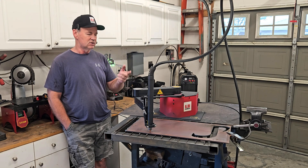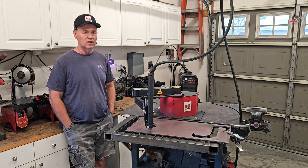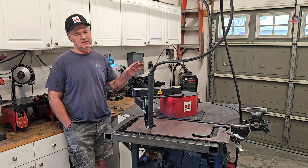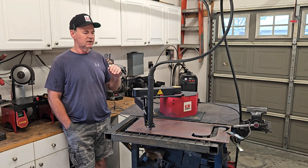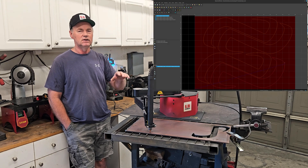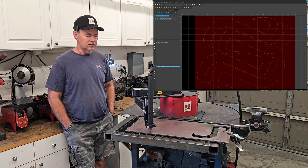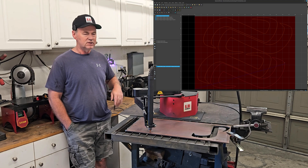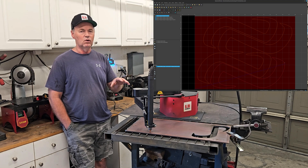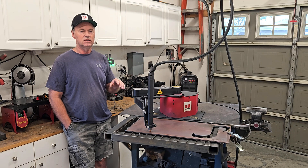The only material I have is the remnants from the piece I bought just to try it — it's a 12 by 16. So I did something I haven't done before: I got into SheetCam and did nesting. Not nesting like pregnant ladies building a house — nesting meaning taking the parts and arranging them on the material so that you can maximize your productivity on the material.